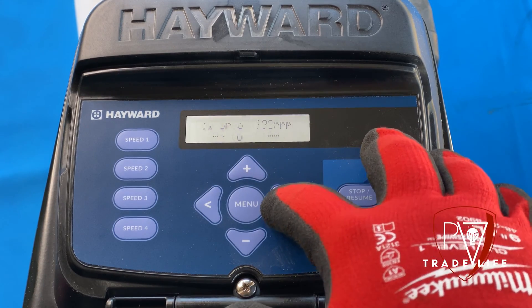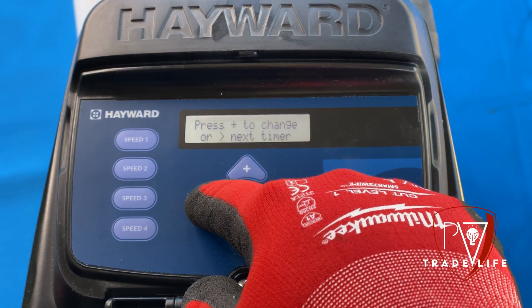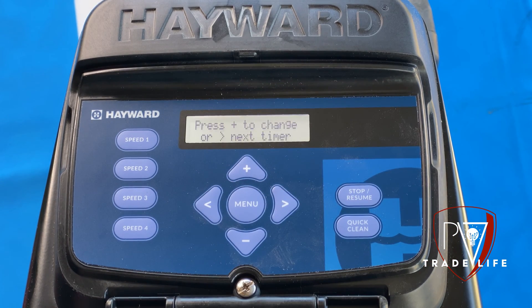Now, once you're done with that, we're going to go to the next timer. I'm going to run high speed in the middle of that 8 AM to 8 PM window — from 2 PM to 4 PM. This is how you're going to get your high speed, because timer one is going to take priority over timer two. For you Pentair guys, you never had to worry about that because on a Pentair pump the higher RPM takes priority, but on this Hayward pump it doesn't work that way — it's not the higher RPM, it's the actual timers. Timer one always takes priority over timer two, timer two always takes priority over three, four, five, six, seven, eight.